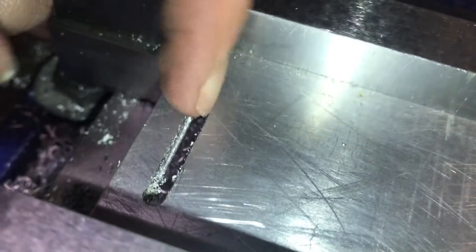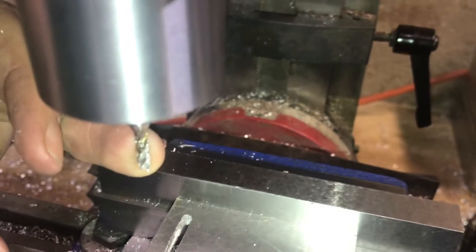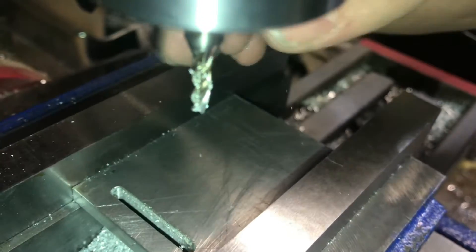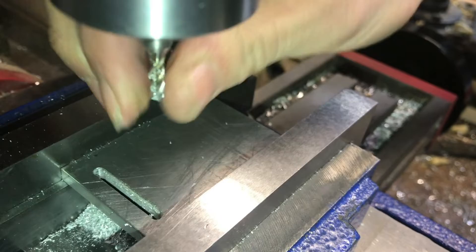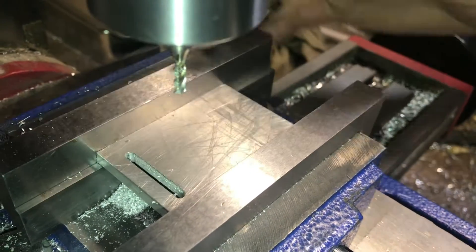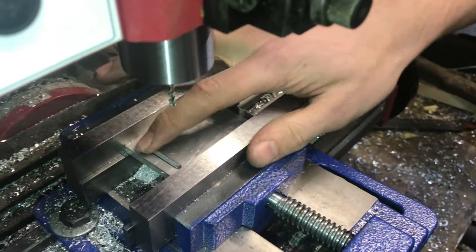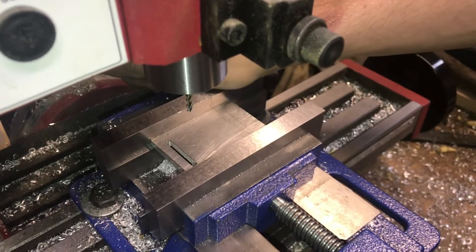You can see the surface finish on the inside isn't too great. There are a couple of things we could have done to improve the cut. First of all, this is a four-flute end mill — often two-flute end mills work better for slotting because there's better chip clearance. If we used finishing passes, it would also give a better finish. Because our slot width was the same diameter as our end mill, we can only take one pass in the X direction. If we were using an eighth-inch bit and making a 3/16th slot, we could do one pass in the center and then move over to take finish passes on each side. But if the slot is the same width as the diameter of your end mill, you can't do any finishing passes. So if you want a better finish, you can use a two-flute end mill. But this works really well for what I'm doing. I hope this is informative and useful if you're trying to make your own slots — if it is, don't forget to like and subscribe.